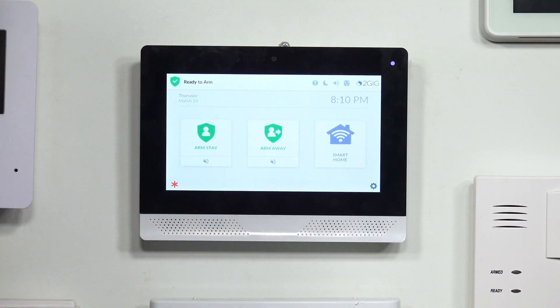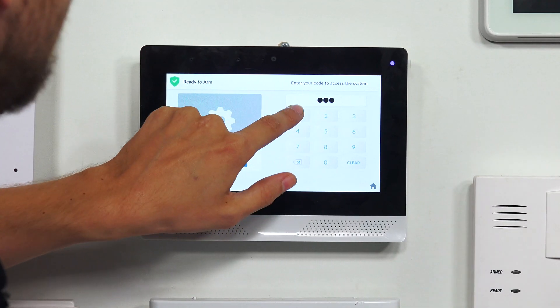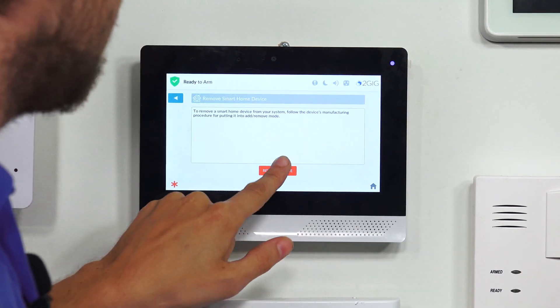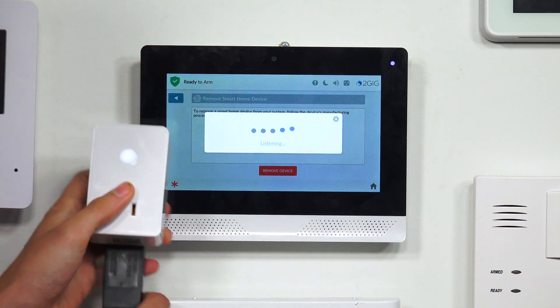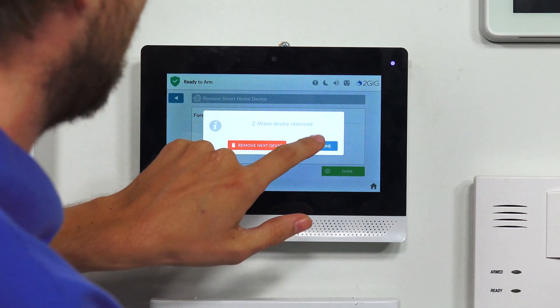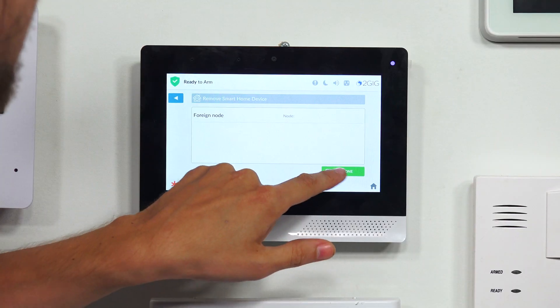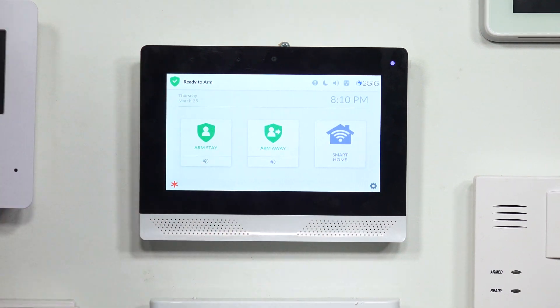If we wanted to enroll it with the network, we could go ahead and do that. But remember, we could also clear the device from the network even if it's brand new and not enrolled with any Z-Wave network. Just to show you that's a possibility — if we go back into the Z-Wave network settings, we can remove the device again. Even though it's clearly not paired with the network, if I press the button, it still detects the device. It says it's a foreign node, because it doesn't know exactly what Z-Wave device this is. It just knows it's a Z-Wave device and has cleared out any residual Z-Wave network data. So even if you have a brand new Z-Wave device, it's still a good idea to do that.